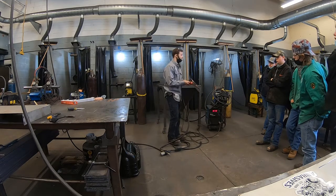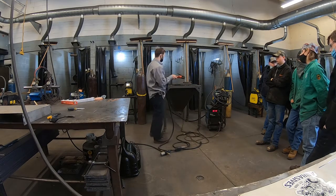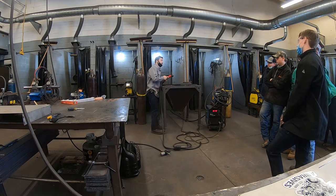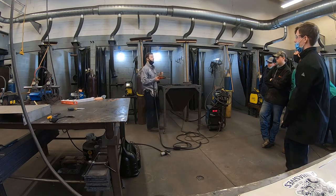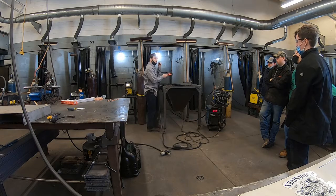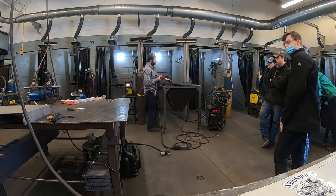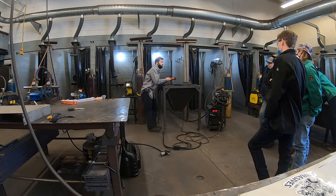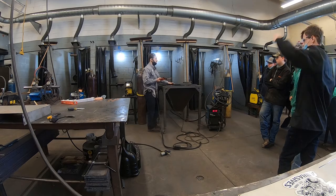Get in the habit of turning the air on before you try to start your arc. It's unlike stick welding where you tap to start — with carbon arc, all you have to do is get close, and as soon as you touch it to the metal, it's going to start blowing. Typically you want about a 45 degree angle. If you want more penetration — to burn deeper into the metal — move that up to 60 or 70 degrees. If you just want to remove weld from the surface without digging into the metal, drop down to about 30 degrees. The angle controls how much penetration is given to the metal.